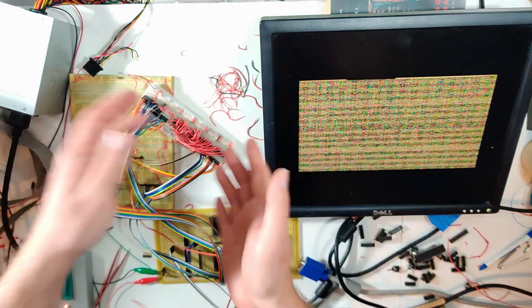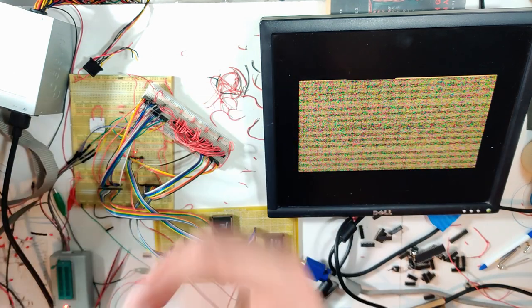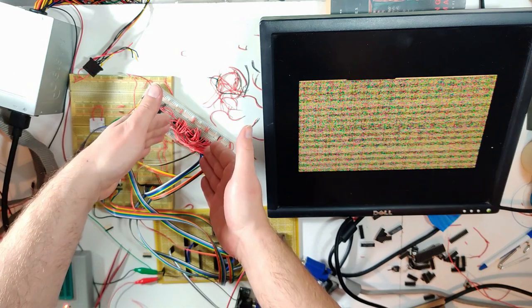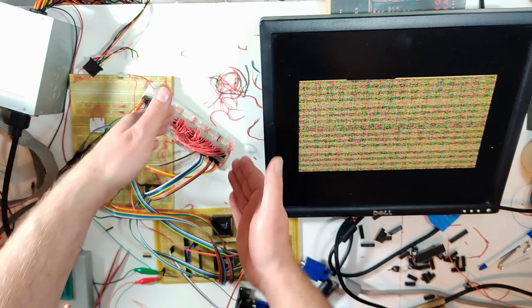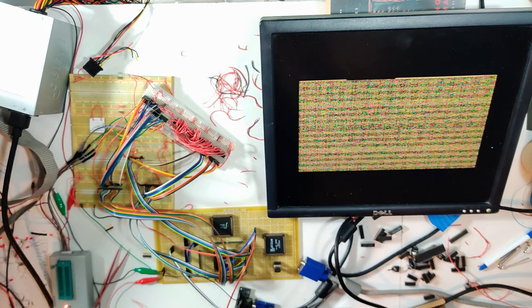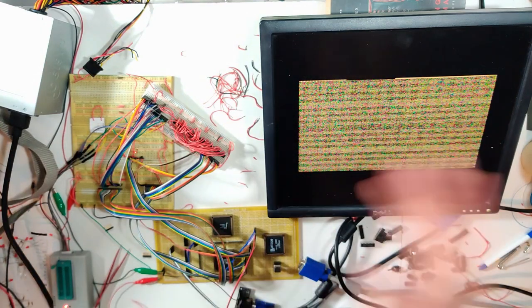4 74574s. They're 8-wide ganged flip-flops, so they have a common clock, but there are 8 ins and outs. 2 of them are acting as a shift register, and then 2 of them are acting as a latch so that it changes synchronously. Oh boy. I still have issues, but I'm calling it. It was definitely something about the crazy address crap with the 2 AVR thing.